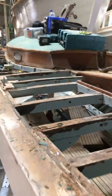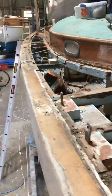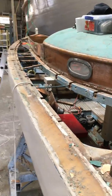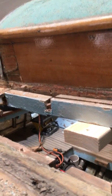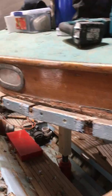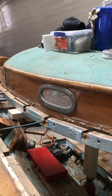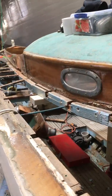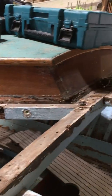Just going to step over some things here — not kill myself! Basically the carling and those half deck beams look to be in a state of disrepair definitely. You'll see that the carling has actually broken just where they split the bit of timber vertically to get the shape around the deck house. They split the timber vertically but then notched out for their little half beams, and that's what has caused the break I think. But so far it's nothing that we didn't expect.